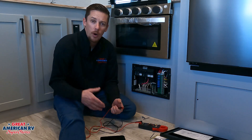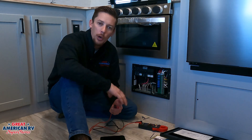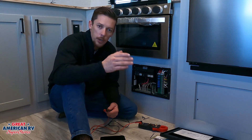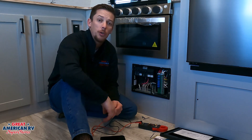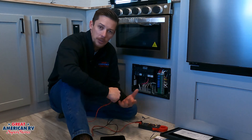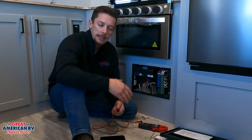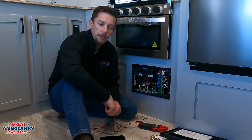To get by, if you are at a campground and your system is dead and you just don't have any other options, go to a hardware store or automotive store and pick up a battery charger, plug it into your outlet at the power pole right by the camper, and put those clamps on the battery at the front of the unit. That will get you by through your camping trip. That's all this converter system is — just a battery charger conveniently located so you don't have to clamp and unclamp it from the battery. In a pinch, go grab a battery charger from any hardware or automotive store and save your trip.